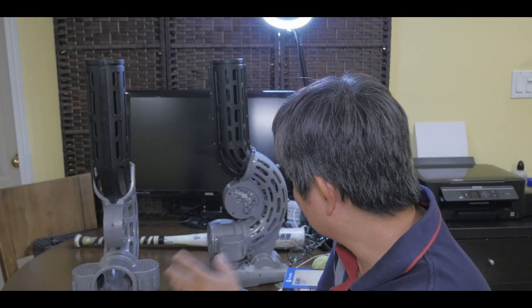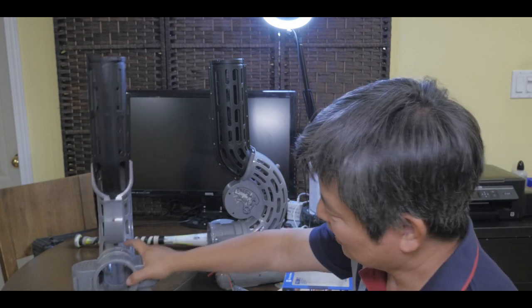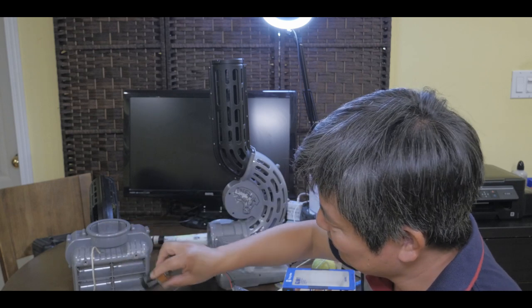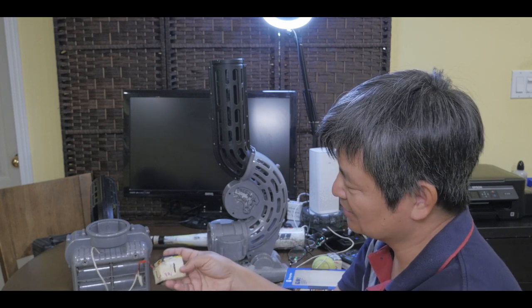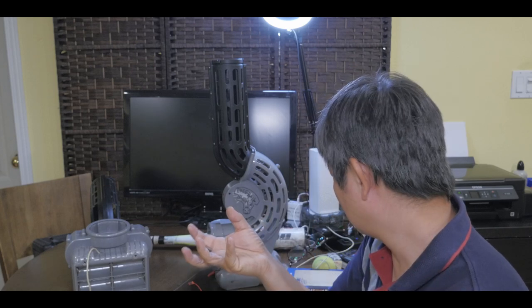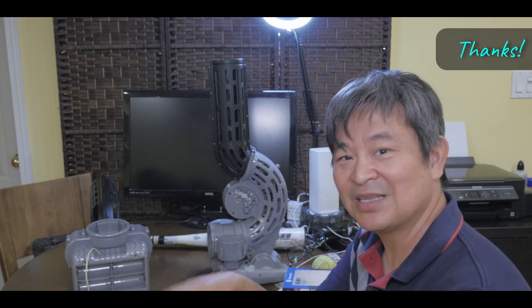All right, so I'm finished now. I now have two baseball or tennis ball launchers. The good news is that I didn't have to modify the battery system in a sense that the alkaline battery system is still intact — I can just put the alkaline battery in there and it will still work as a street hockey passer. Or, if I want it to be more powerful, I'll connect it to my lithium ion or lithium polymer batteries at 7.4 volts — either 4000 mAh or 6000 mAh — and it will be able to launch a tennis ball or ball hockey ball really well, either as a batting practice or tennis ball launcher. It works both ways. Hopefully you enjoyed this video — don't forget to subscribe and give me a little heart of appreciation. Talk to you soon, bye.